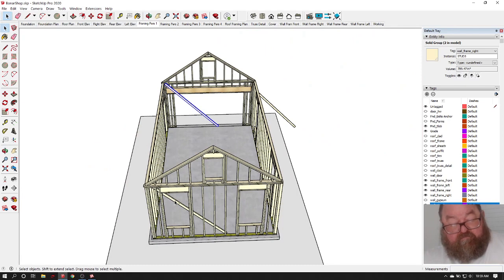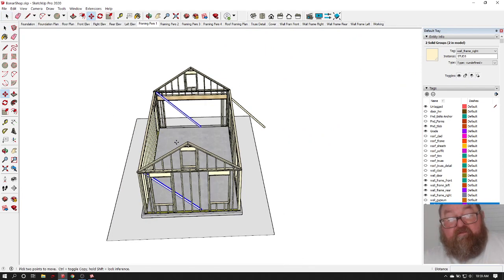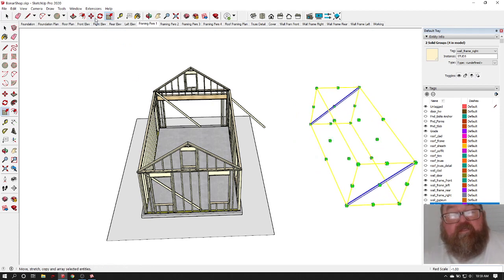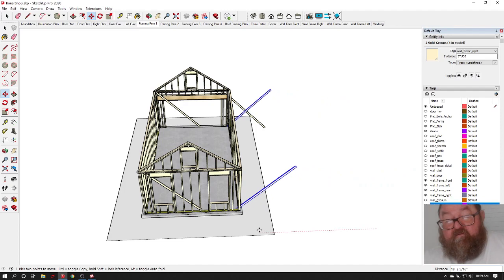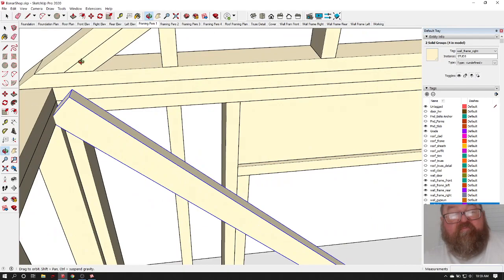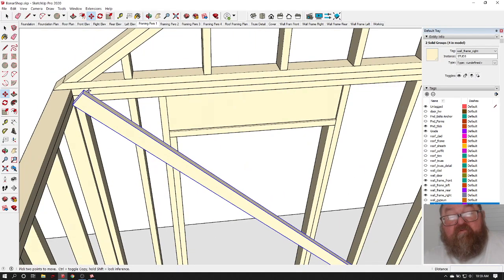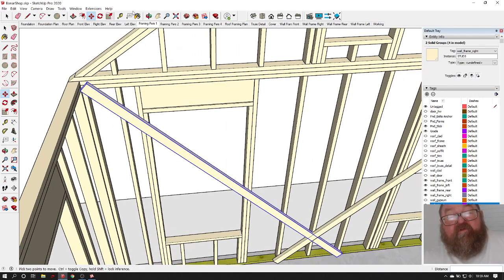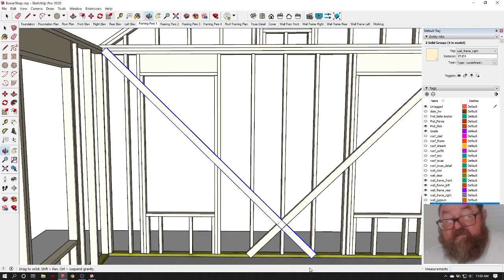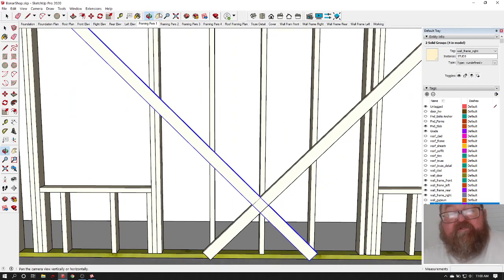What you'll do next is take them and, let's just turn them around. I was going to mirror them. Yeah, let's mirror them so I don't have to worry about exactly where they're located. What this is going to allow you to do is obviously brace off your walls, but also get them really plumb. Before, what you'll do is nail this at the top, and then have somebody hold the level out here, like a 6-foot level on the corner, and when you get it plumb, you'll say nail it. And these will be nailed over the top of each other.